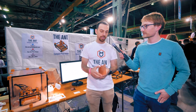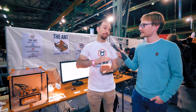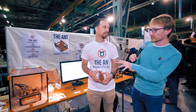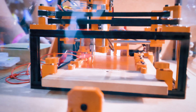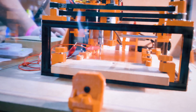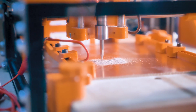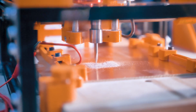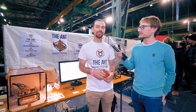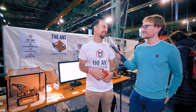These boards that are €2 to €2.50 have copper that is not perfectly flat, so we have to compensate for that. The probing itself happens electrically — you can see alligator clips hooked up to the actual bits. It's an ER8 standard chuck, and for the probing connection it's just a headphone cable that we cut and connect with crocodile connectors.